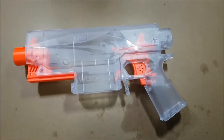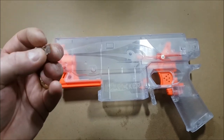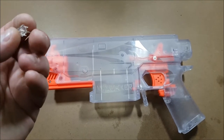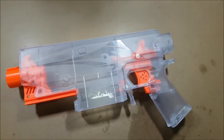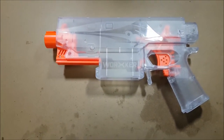I have got some Cree LEDs. They're what they call a Piranha-style LED, so a magnifying dome, but they're extremely bright, and you can actually solder them in different configurations. They're a four-pin — two positives and two negatives — so they're ideal for running in sequence or in series. Depending on your voltage, you can run them in series or in parallel.